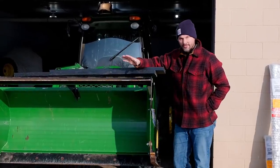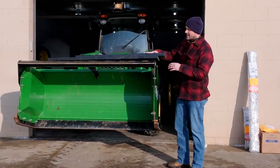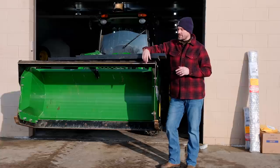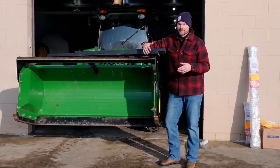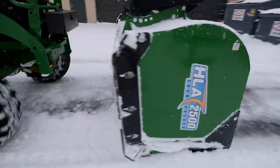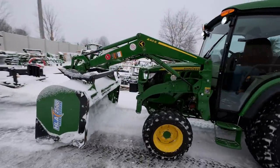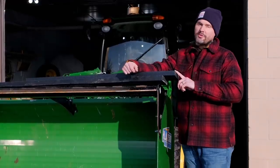Good question from a lot of folks: how long is that edge going to last? Whether it's a steel edge, rubber, or UHMW — the material doesn't matter as much as how often and how much you're using the plow, pusher, snowblower, or bucket edge. The more you use it, the faster it's going to wear. If you have a really easy winter or a very small driveway versus a thousand-foot drive or commercial use, it's very hard to pinpoint how long the edge is going to last. Steel will typically last the longest, with UHMW not too far behind, while rubber protects the most but wears the fastest.